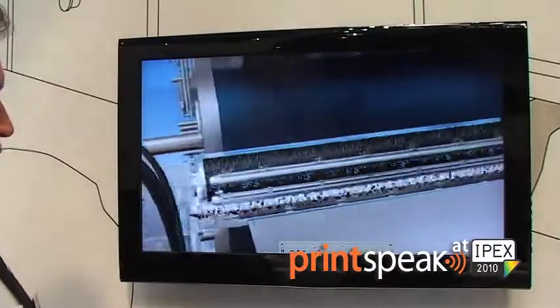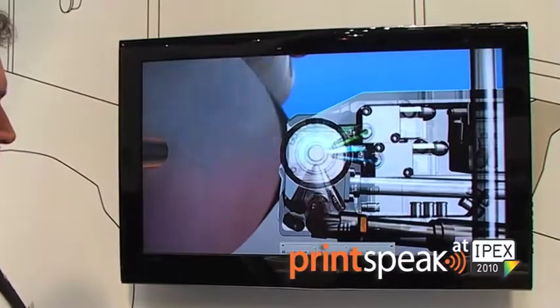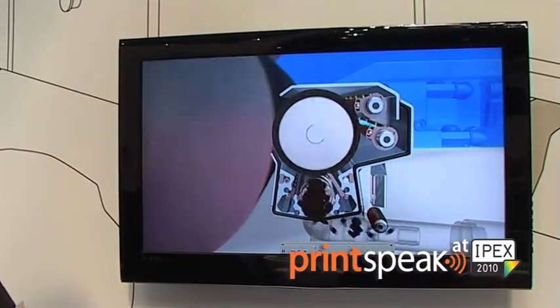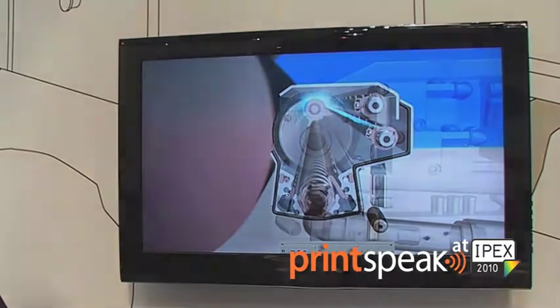At the end of the washing sequence we are just moving out the dirt and drying the brush. You can see that the spray goes to the brush and runs with the brush to the blanket before it hits any blade. The blade goes in contact after the brush is contaminated with dirt, and the dirt goes to the chamber where the spiral moves in and pushes the dirt out of the system.